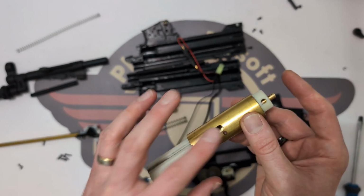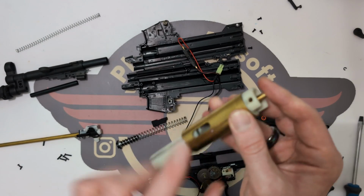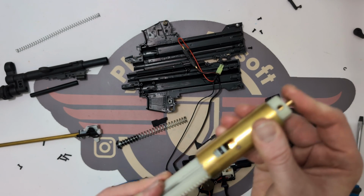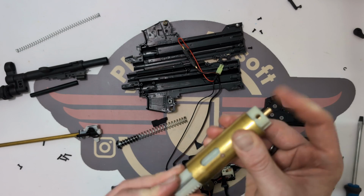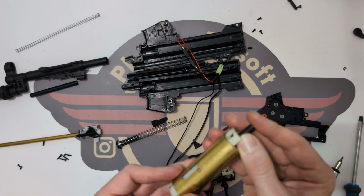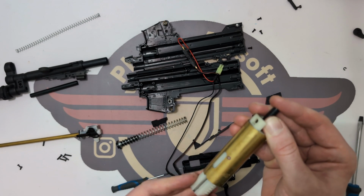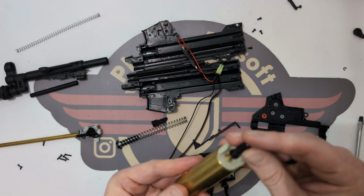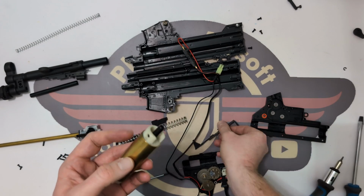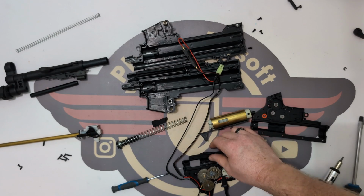So what I'm looking for in this vented cylinder is I shouldn't get far past this vent with my finger over there, and I should lock it up basically with air compression. So ooh, yeah. Yes, excellent compression. We'll try the same thing again with the air nozzle. Now I expect that there will be air leaking here. There is, but really not a lot. That's taking some real force. So that took a lot of force to get that out then. The compression there, again, considering the price point and everything, is pretty impressive out of the box.